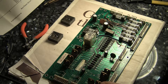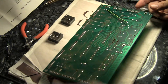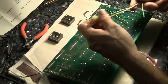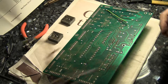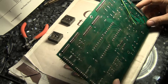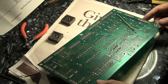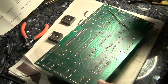So I'm slowly making progress. I've identified the traces and I'm going to do the jumpers. What I'm using for jumper wire is an old Gottlieb System 1 connector cable that I pulled out of another machine — it's got some nice gauge wire, so I'm just going to cannibalize some jumper wire from this. I'm careful to use heavier gauge wire than the traces because I think there's some high voltage running across here. I also want to make sure that when this is done, it doesn't accidentally touch against anything else, so I'm going to double and triple check everything. Then once I get all the components in, I'm going to do continuity testing against the schematic.